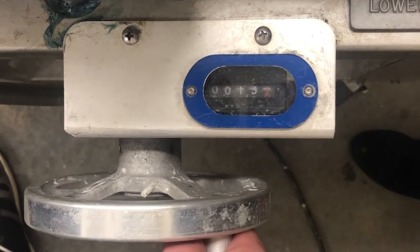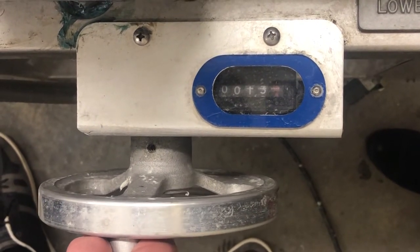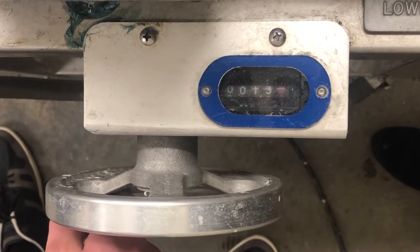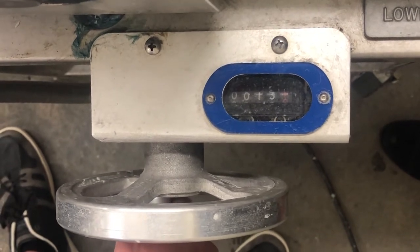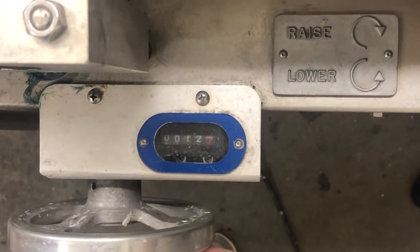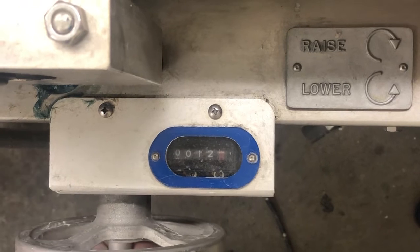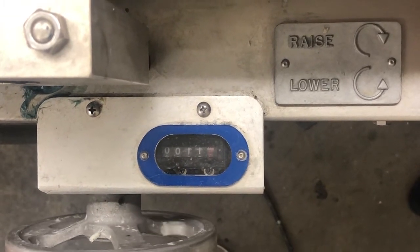This is the actual pace that we were cranking down, and I don't want you to have an unrealistic sense of how fast you might go. Here in a second I'll give you the audio of the increased sound produced as we're getting down to 13 and a little below. So basically you proceed like this — cranking down until there's a noticeable increase in noise or the machine is vibrating a little more, then pausing for five to ten minutes.